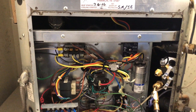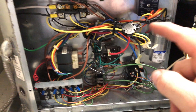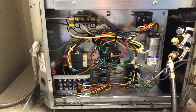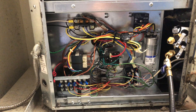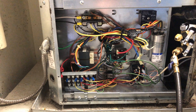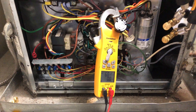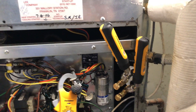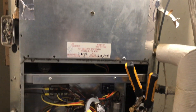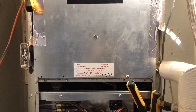I've got the 50 ounces weighed in, the control panel put back together, everything wire-tied and secure. Normally the run capacitor and start assist are on the back side of this panel — that's a bad design if you ever need to check them easily, because you have to take the whole thing apart. So I relocated them to make everything a lot more service-friendly. Got the equipment started up in cooling mode, checking amp draws — the compressor looks good. Checking pressures, return temp, supply temp, and suction line and liquid line temps with clamp-on probes, including subcooling and superheat.